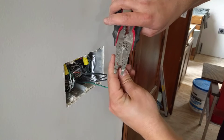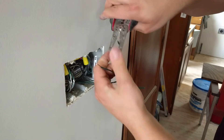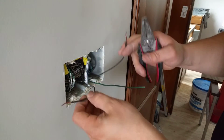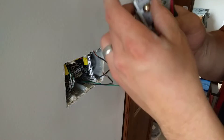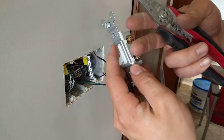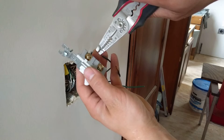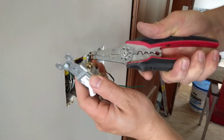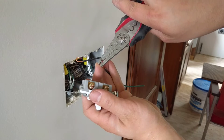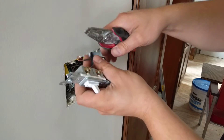We're going to want to strip about three quarters of an inch of insulation off of these — I had about a half inch already stripped. It doesn't actually matter which wire goes to which spot on the switch itself, but for the sake of being able to remember it, I feel like it's a good idea for the top terminal to go to the light and the bottom terminal to be the power coming in, though it could work either way. We're going to go ahead and bend loops in the direction that the screw tightens, so that as you tighten the screw down it tightens the copper wire around it.